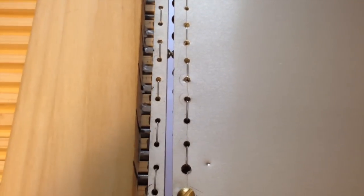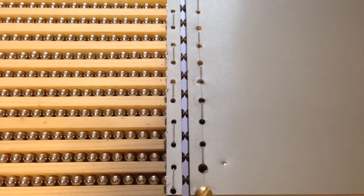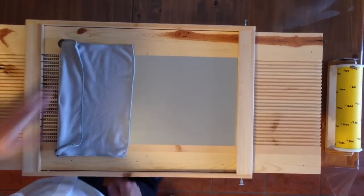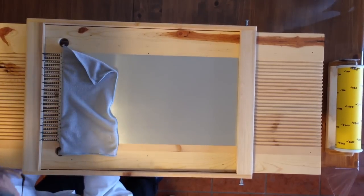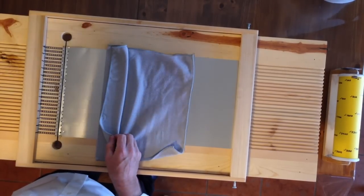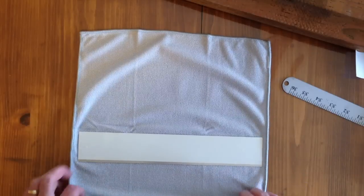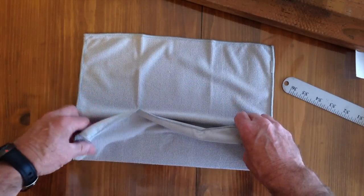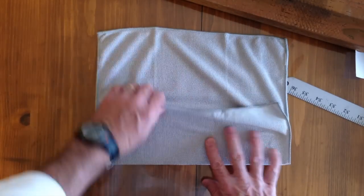To clean magnets, slide the frame to center the contact points of 25 pairs of magnets above a slot cut through the slab, and insert a microfiber cloth through the slot to clean these 25 contact points, moving the cloth both upward and downward through the slot. Then slide the frame to center the next set of contact points above the slot, etc. A strip of thin aluminum flashing, to which the microfiber cloth is taped, provides the framework that enables the microfiber cloth to be pushed through the contact points.